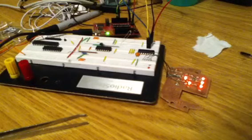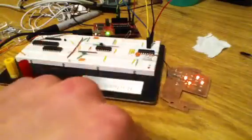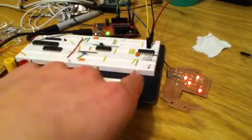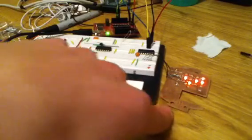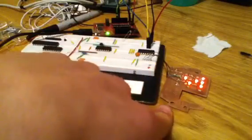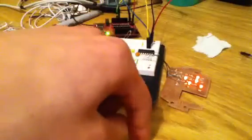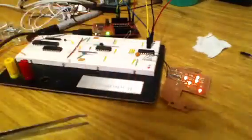except for the LEDs. The LEDs are all SMD, due to size restrictions, but the MSP chip here is the one that's actually going to be inside this board. So that is a through-hole component, and I have through-hole spaces on this board, but they're all on the top surface because I didn't want to make a double-sided board, because that's just a pain when you're doing the toner transfer method. And so I have to solder these components in pins down in this orientation and then solder them to the top surface, which is a pain, because usually you'd solder through-hole components on the bottom.